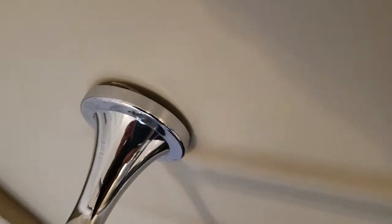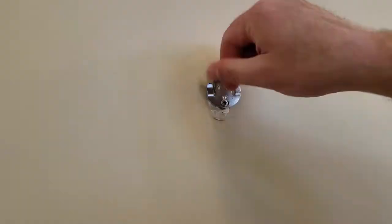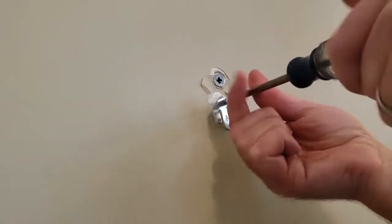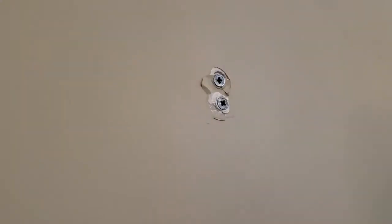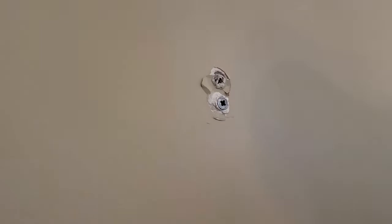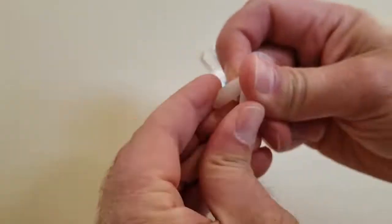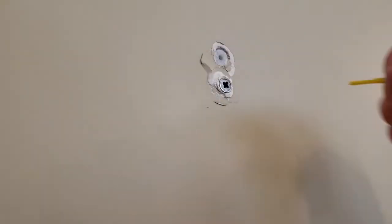Here's something to fix. The towel bar is falling off the wall, so we'll take it down. This bracket needs to be removed — we'll unscrew it, remove the bracket, and take out the wall anchors. These wall anchors leave very large holes. We'll try using new anchors and see if we can just pop those in and be quickly done with this project in 10 minutes or less.